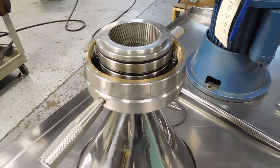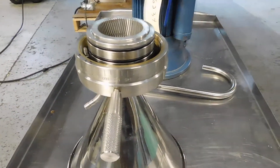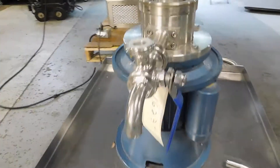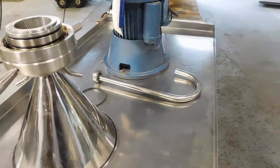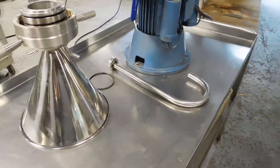The two arms here work the adjustment of the stator position against the rotor by mechanically moving up and down. You'll see there are two o-rings which seal that into the body, and the threaded body here is what screws onto the head. There's also a small hopper and a recirculating tube; connections are standard European DIN type.